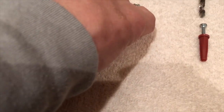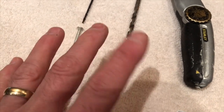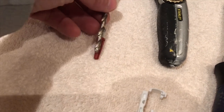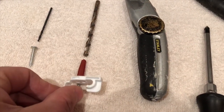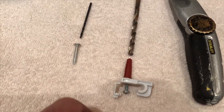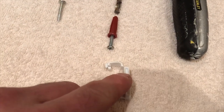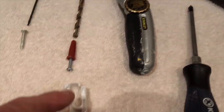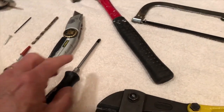You don't want to gouge out the hole — you want to leave something for the screw or anchor to grip onto. Size it up and use something a little smaller. This is the anchor I use. These are the brackets I use. These came with an anchor, but what I did in a couple of them is I just cut off the anchor part using a utility knife because I was going into a stud. You don't need the anchor if you're going into a stud.